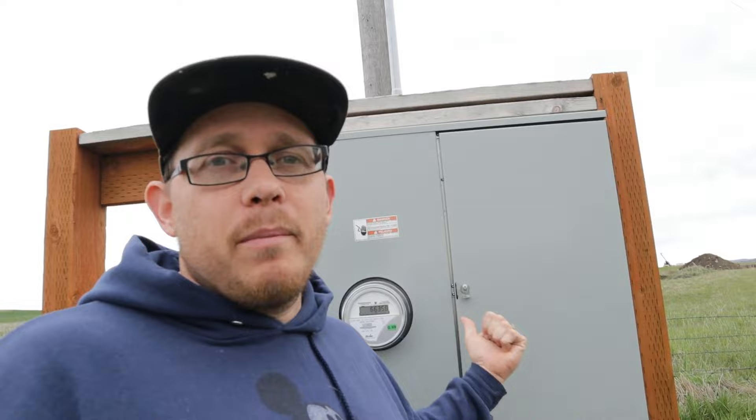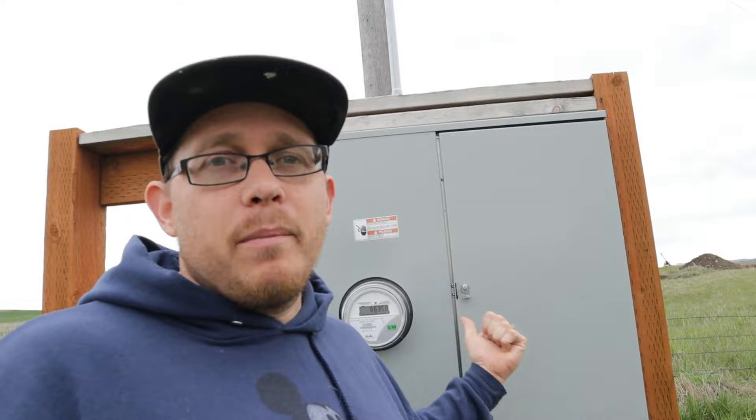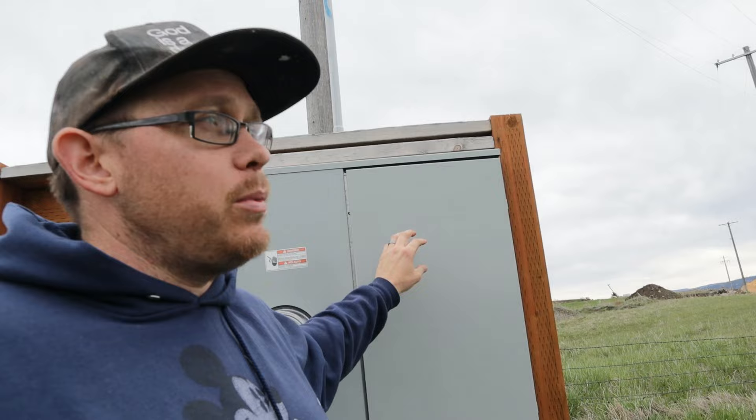With power, we have a 400 amp panel. Our plan is to build our shop house right over here, and eventually build a main house past where the goats are — so the shop house will eventually be a guest house. We have a power pole right here on the corner of our lot, and our transformer is up there. With the 400 amp service, we can sub-feed two 200 amp panels — one at our barndo and one at our main house.